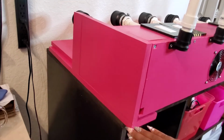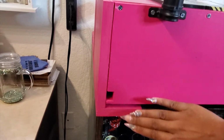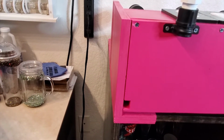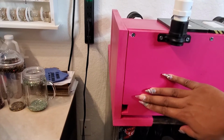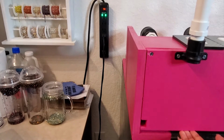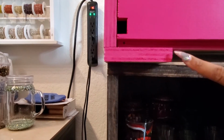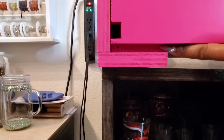So when this is actually 24 3/4 inches long, what happens is your back piece here actually sits on top of the support. Okay, so it sits on top of the support, and then your back piece and your base make an L. That's why this has to be 7 3/4 inches, because it accommodates for the 3/4 inch thick piece of wood that is your base. So because I had issues, this is actually only 7 1/4. But if you can see here, if this had been 7 3/4, it would have met right here.